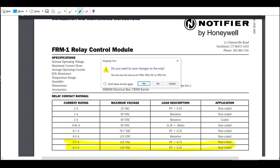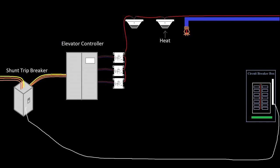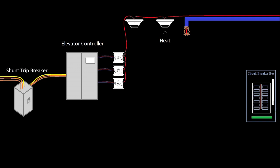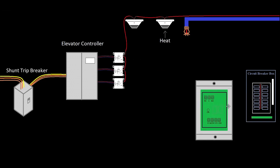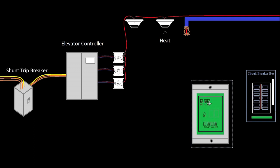The way you have to wire this gets a little complicated to look at because there's a lot going on, but if you take it one at a time it's not too bad. We're going to bring into the picture a relay I've used before — an MR101. The only difference between this and an MR201 is that the 201 has a second set of contacts so you could control two circuits. You don't need the second set, so we'll just use the 101 for now.